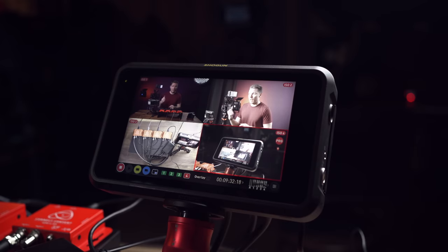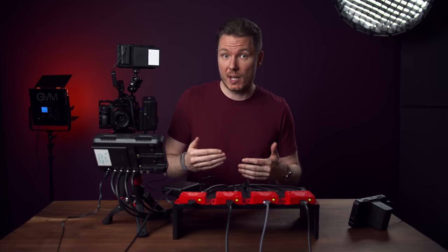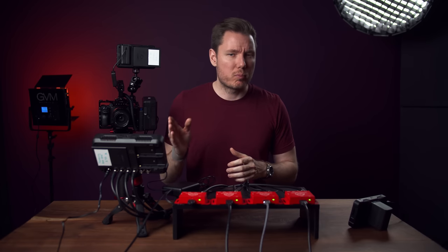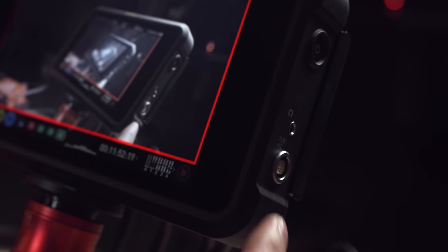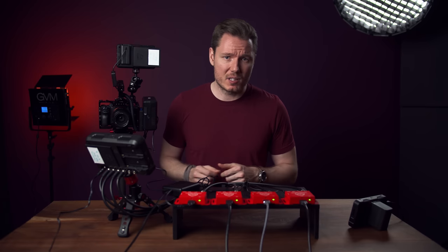Audio and video from camera one, camera two, camera three, and camera four. If you don't want audio to follow the video, you have two options: record your audio separately and sync in post as usual, or re-enable the analog track and record directly into the Shogun, since this device supports XLR mics and provides phantom power. However, there's a big caveat — there's no breakout cable included this time. It was included on previous Shoguns, but they removed it on this model, so you'll have to buy it separately for about $150. That breakout cable converts the mini connector into proper XLR leads, and it's notoriously wonky — it puts unnecessary strain on the tiny port and costs way more than it should. I'd rather record externally to a MixPre or Zoom; that's a better use of $150 and provides more secure connections.